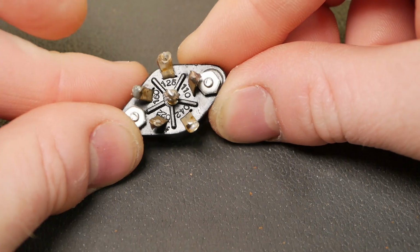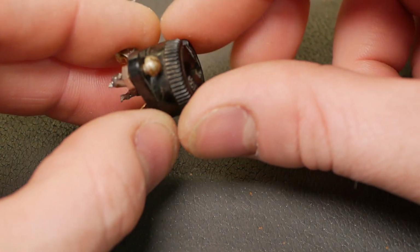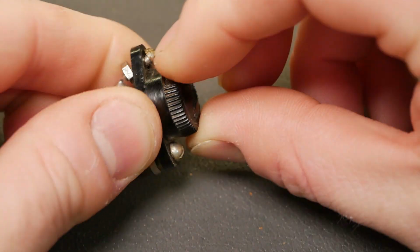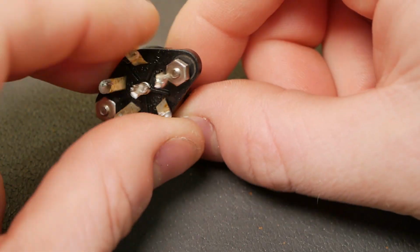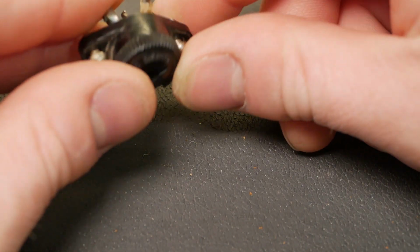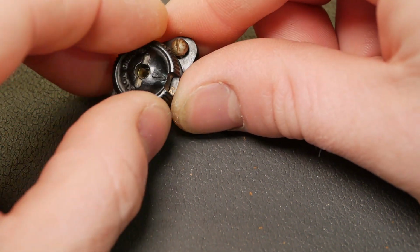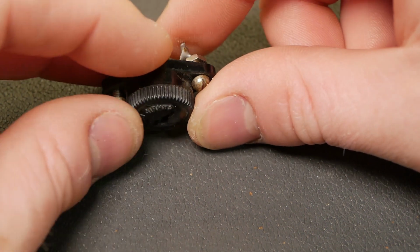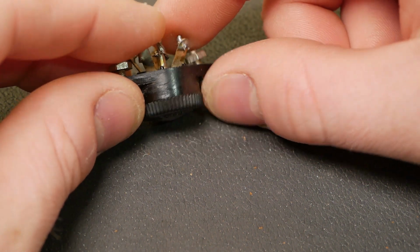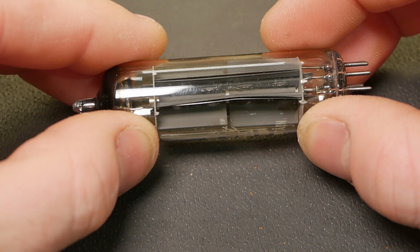The other issue was that at the best of times the contacts were showing about 5 or 6 ohms where it should have been close to zero, so I'm not confident that I could have taken this thing apart without destroying it. So we just locked it into 240 volts. It came in set to 220 volts, which I think damaged the rectifier valve.